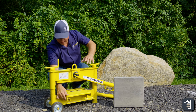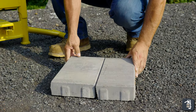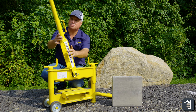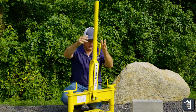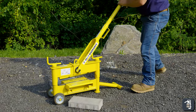The table is spring-loaded with a little bit of angle adjustment so you can get that undercut, so when you butt against your last laid product it has a nice crisp joint. This is what's classically labeled as a speed splitter. You're going to use this lever to come down — with a removable handle you slide this in — and that gives you the leverage needed. Bounce on it a couple times and you're going to split your product.